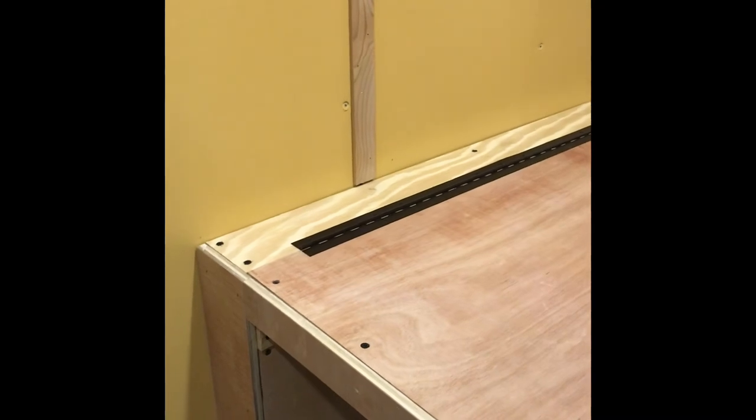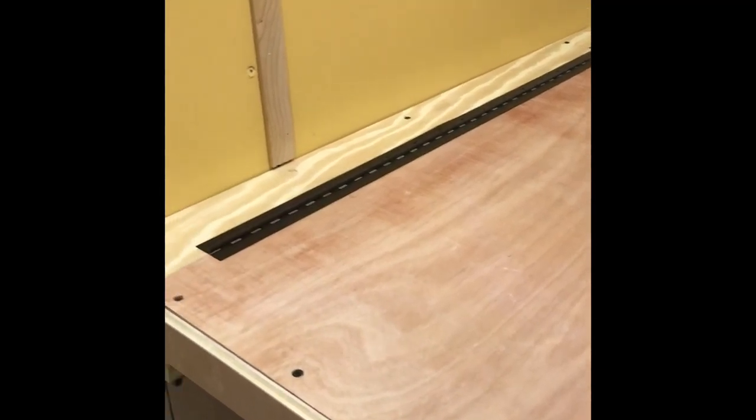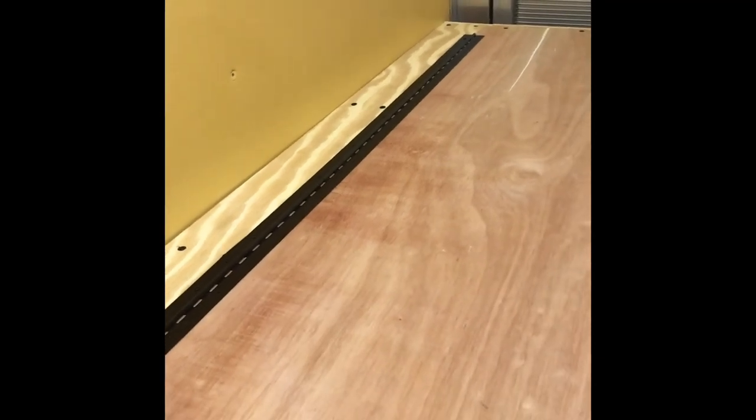This is without the cushion on it, so you can see it's half-inch plywood framed with one-by-four — a variety of lighter-weight material. Piano hinge again. I think four 48-inch piano hinges went into the making of this. Each of these flip-up sections has one piano hinge for the flip-up and then one piano hinge for the leg.